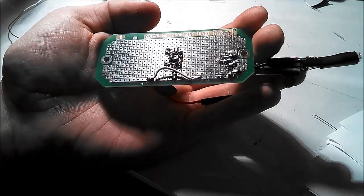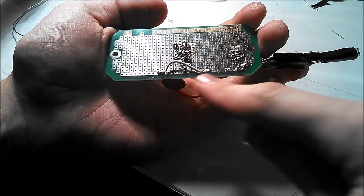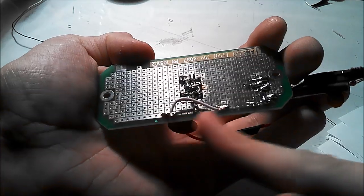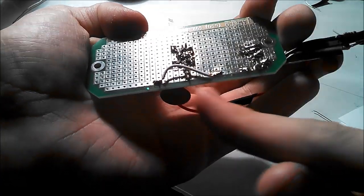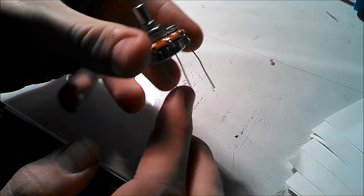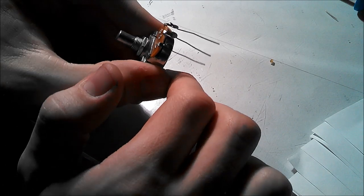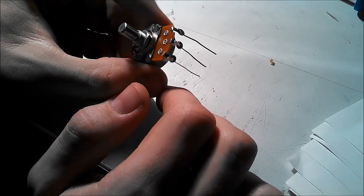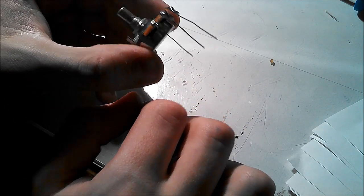In step twenty-one, connect the ground buses — these two strips of metal plates that are all connected. There's a strip where they're not connected, so you need to put a small jumper wire to connect both of them. The next couple steps involve attaching the potentiometer to the protoboard. The easiest way is to solder wires from the three leads — I repurposed leads cut off from resistors and capacitors since they're firm enough to insert into the protoboard.